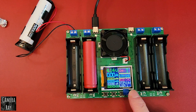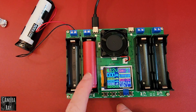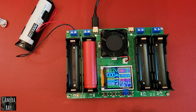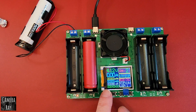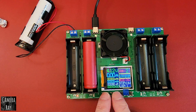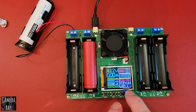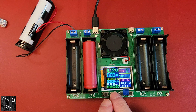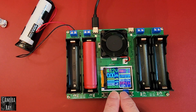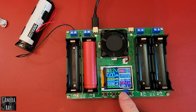Since we've got this connected, we can use the other bay too. On the far right button, click from bay one to bay two — bay two is showing 4.2V and charging at 0.12 amps. I've got this one charging, but I want to discharge the other one for storage, to bring it down to a lower voltage like 3.6V for long-term storage. Once I go to channel two and click through, I want it on discharge mode.